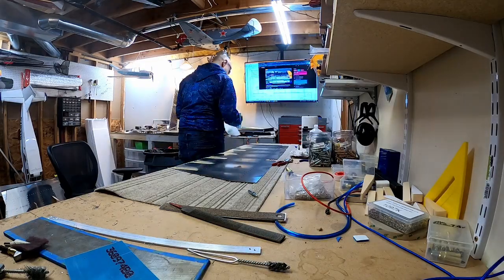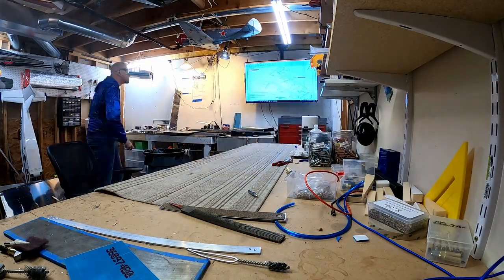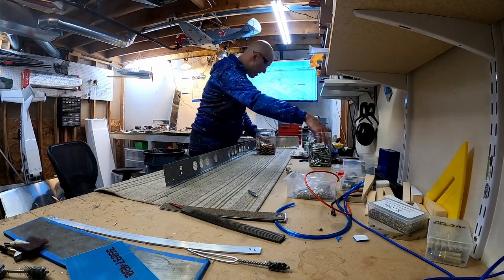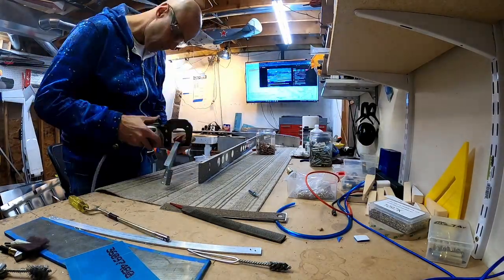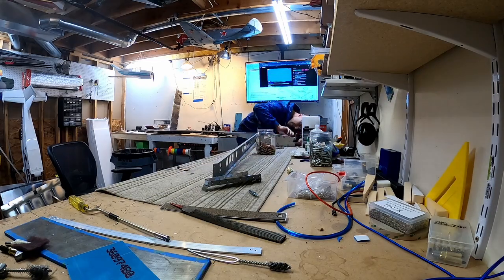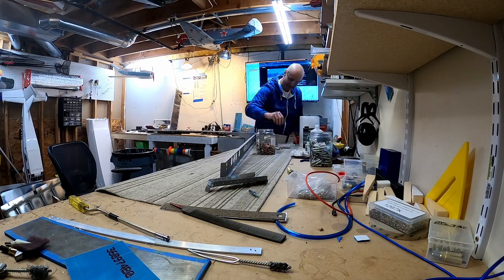This is some leftover footage from scuffing and cleaning the skin for the foam ribs that go in the trailing edge of that skin. We're putting together the skeleton of the left elevator right here, and then we're going to start riveting on the tip rib.